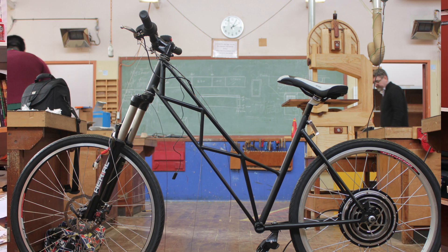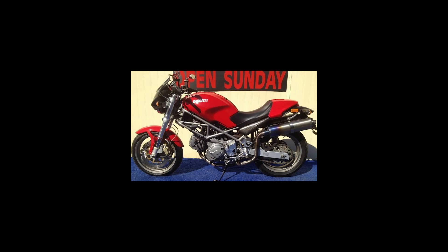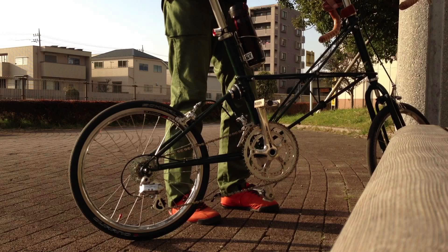Space frame, trellis — whatever you want to call it. You'll see it in motorcycles; the Ducati Monster has a trellis space frame. The Moulton bike uses a space frame with small tubes, giving very good torsional rigidity and excellent strength. Moulton does use suspension to offset that, but it also has small wheels which means it needs it. The key benefit is you'd have all these spaces in the frame to store your battery and electrics, shielded away in a very clean frame design. Using that inspiration from Moulton and other space frame bicycles might really work for this sort of electric bike design.